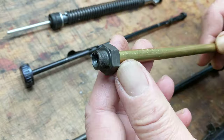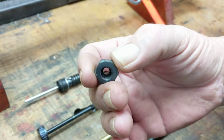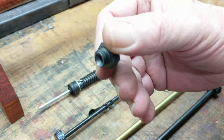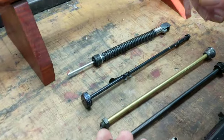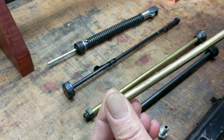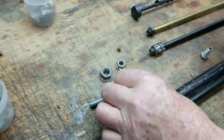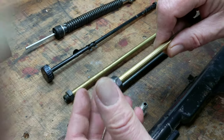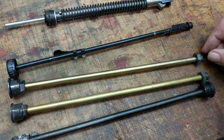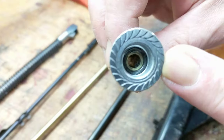Same on this side, but because the 7/16-14 started out as an automotive bolt from AutoZone, what you've got to do is drill a hole through it as centered as you can. Then you've got to chamfer both sides of the hole because this is the side that will present toward the plunger face, and then you need to cut it so you've got like three or so threads showing. Then you take your threaded brass tube — this one is not a tight bore, it hasn't got the wall thickness — but if it was a tight bore, you could thread this into that, and then take a completed assembled section and thread it into that. You would wind up with an air tube that you can put in your Daisy that allows you to shoot airsoft 6 millimeter diameter BBs or half-inch cork balls, because you're going to bore this out to a half-inch diameter right there.